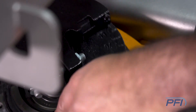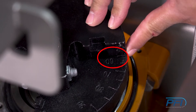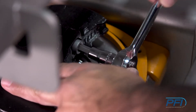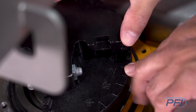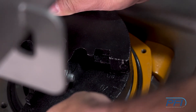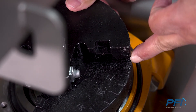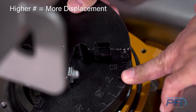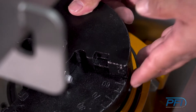Once we get to the counterweight, you'll notice that we have numbers on the counterweight. It may be a little difficult to see, but right now this counterweight is set at 55%. We can see all the different numbers on this counterweight, from 0 to 100. The current setting is at 55%, using the arrow indicator right here. The line there shows that it's 55. To increase the stroke or displacement of the pan, the higher number you go, the more displacement you're going to get. The lower number you go, the less displacement you're going to get. We wanted higher displacement on this unit — we're at 55.